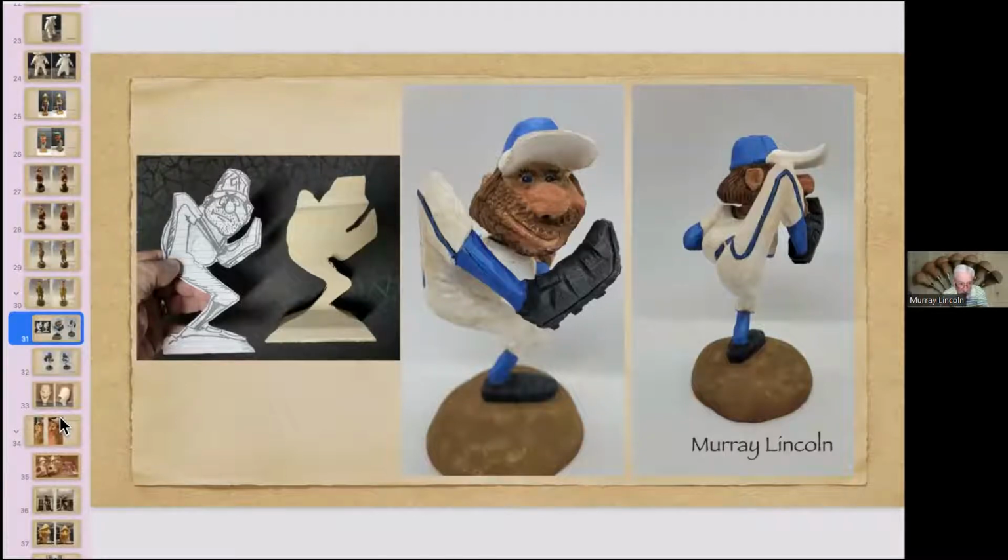I usually add the arms and legs separately, like Mark talked about. One thing that happens with a block of basswood when you go this small, the character is about 5 inches tall, is that you work down on the legs and get down to the lower leg and suddenly realize you have a lot of bendability. You know it's going to crack, and if it falls over, it's going to break. So I've done bone surgery on him. I inserted 1/8 inch dowels into every extra piece sticking out: the thigh, the calf, the shoe, and the lower calf, which comes up from the bottom of the base into his leg. Fortunately, I was able to hit right in the center, and only by luck do you do that.